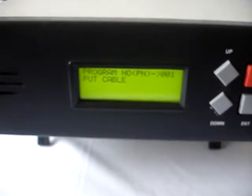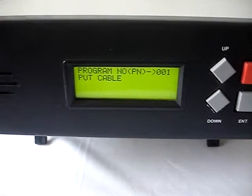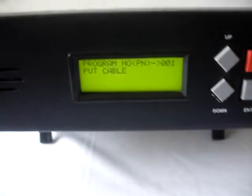Mainly, the fail bin sensor has to be an active high output. The output voltage will depend on the power supply given to the fail bin sensor — it can be either 24 volts, 12 volts, or 5 volts, up to 30 volts. Thank you.